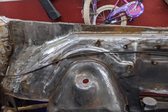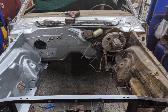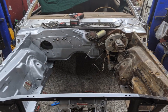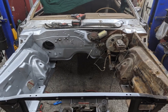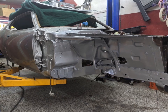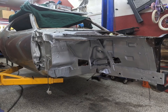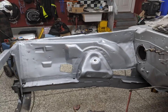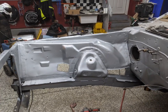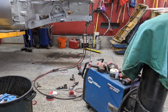I ended up drilling and then putting the mount for the hinge behind it, with more reinforcements to the rust in the front. I filled in all the holes that I won't need and I'll just re-drill if I need to mount wires. I've been doing it a phase at a time — here's kind of a before and after. I've been using a hammered finish paint that I really like for this area because you can grind it down, sand it, and then just paint right over it. It blends right in, holds up a long time, and you can go back and touch it up any time.